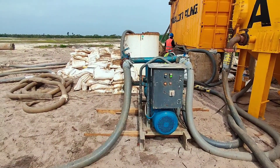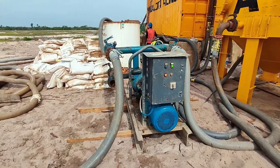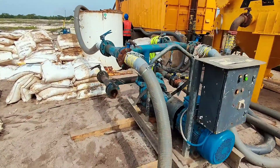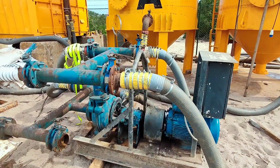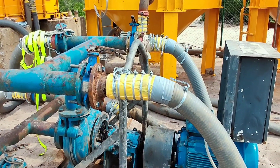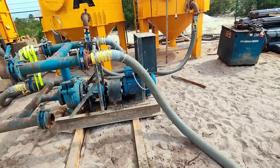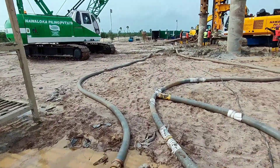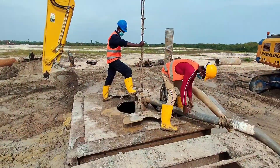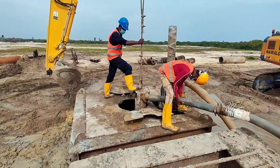This is the mission pump. The hoses coming from the bentonite silos are connected to the bottom of the pump, and it will be pressurized by the pump and go to the top side. This top hose is fixed directly into the tremie pipe, as I showed in the previous video.